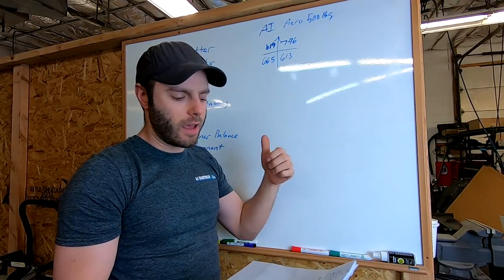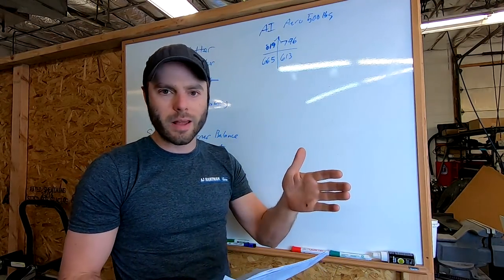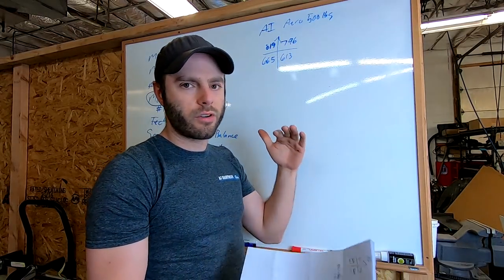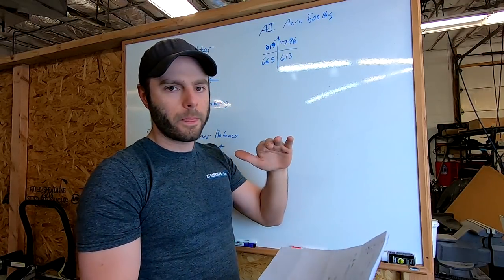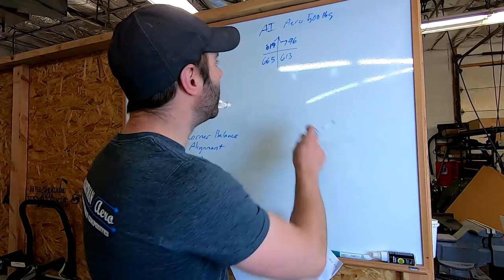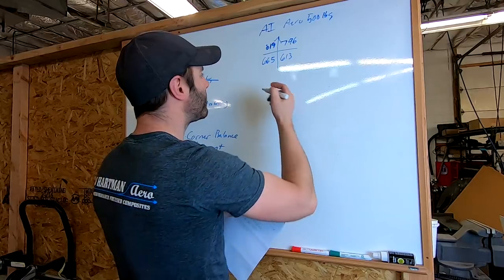The other thing is, if you have a car that has an inboard mounted spring, there's going to be some sort of leverage ratio. Again, we're just going for spring compression to get an idea, so that's all we're looking at right now. So, let's just use the front left for this example.